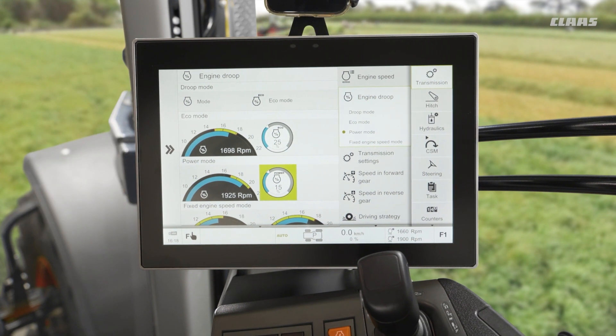This brings us a little bit closer to our peak torque, so broadly speaking around 1550 RPM. For heavy draft work applications we're going to be relying on the torque a bit more, giving us a bit more pulling force and a bit more fuel economy as well. These can then be dialed into proper detail for your own specific applications, but they're broadly good starting points.